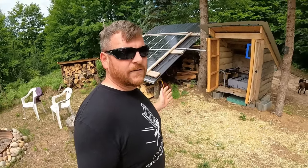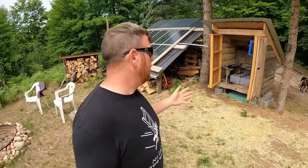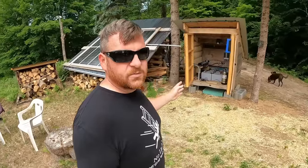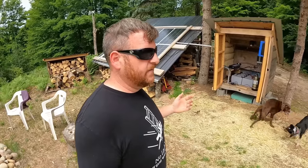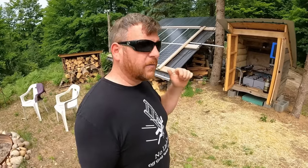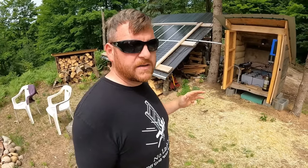There will be improvements and maintenance eventually, so it's not a forever system. Batteries — especially lead acids — I'm hoping to get 5 to 10 years out of them. Everyone says 3 to 5 years and 300 cycles, but I've never had deep-cycle lead acid batteries last less than 8 years. On our cabin, we're simple — we're not running washers, dryers, electric water heaters, or anything like that.